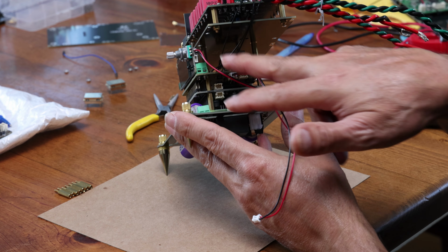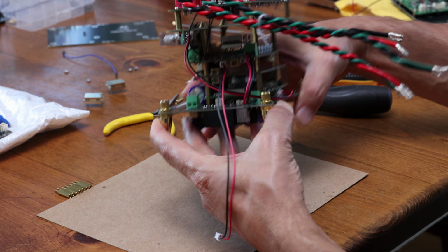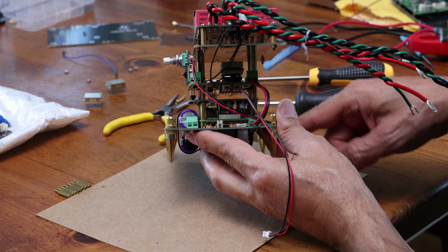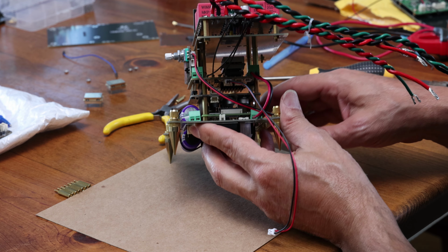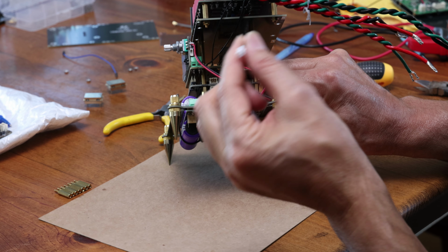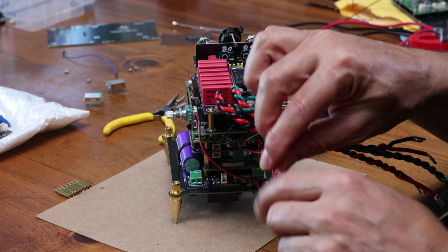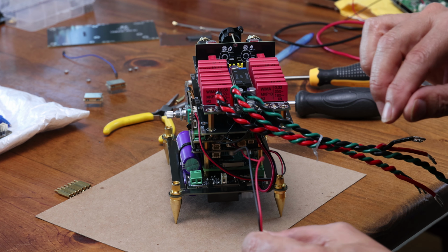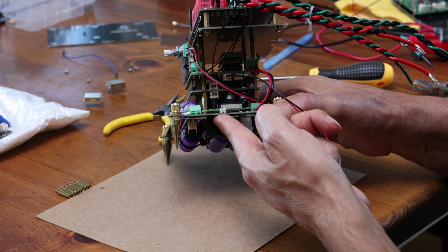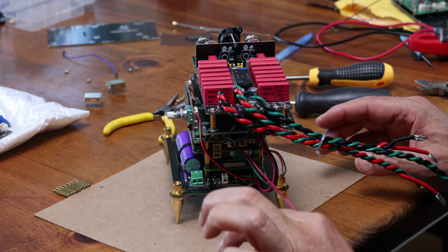Then we have a cable that comes from the Monitor Pi Pro here, and it goes into the J10 of the Ropieee, and this is to keep batteries and the capacitors charging between songs. And this is another one, like an output of that same system. So you can actually send this to a UC Pure power system to also charge those. And from there you can just daisy chain as many as you want. So this is one way when you want to connect the Ropieee to charge between songs and also other UC Pures as well. So that's why you get that cable here.